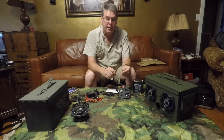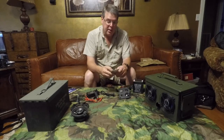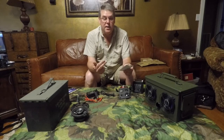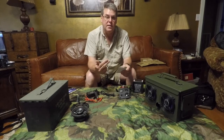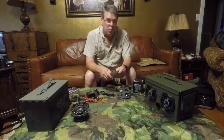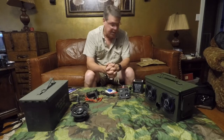because there's going to be a lot of times where you're going to take two wires and go to one, and you'll need to connect those, and you're not going to get two 12 gauge wires into a single 12 gauge connector. You need to go up the next size so there's room to twist the wires together and insert them. We'll go over that later when we're making the wiring harnesses for it. But that's it for the parts. Let's get to the first step.